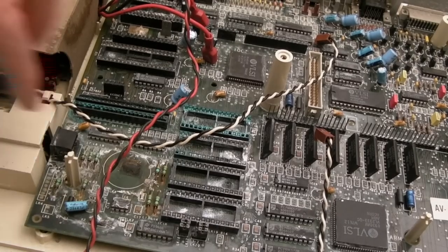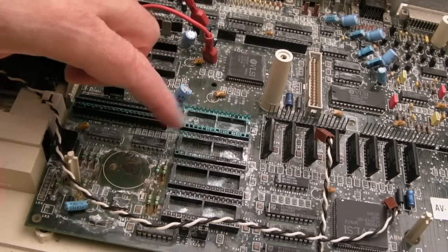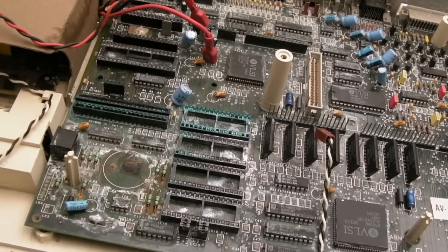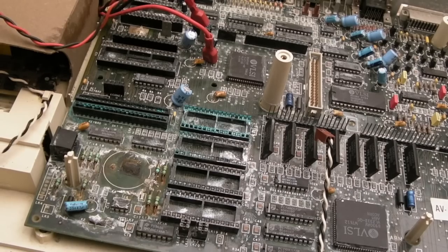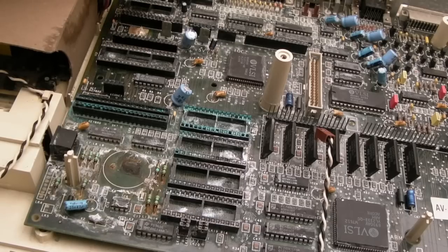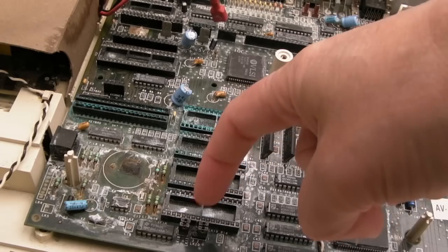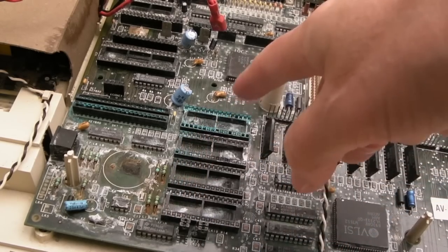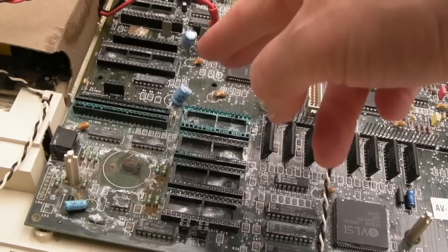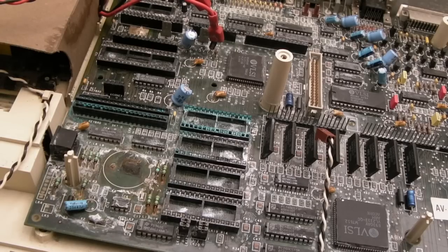So this is the second of the three, and it's the same story. Now, with this one, we've got no ROM chips. I did borrow a ROM from one of these, so that's probably why this has not got any ROMs in it. So it's only going to have three chips there. I could burn an EEPROM for the fourth one, I guess. But then that probably wouldn't work, actually, because the jumpers down here dictate whether you're using EEPROMs or mask ROMs, so you've got to have a set. You know, you can't just have three EEPROMs and one mask ROM. Or, sorry, three mask ROMs and one EEPROM. Unless I had an adapter or something for the chip, I could do that just for that one chip.